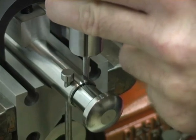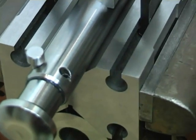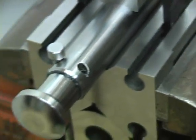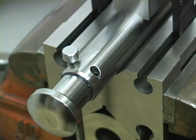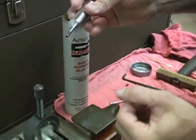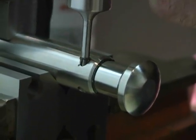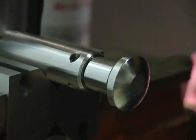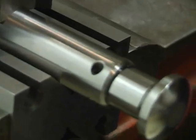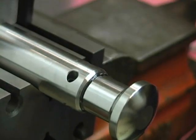You should recess the pin slightly below the edge of the hole. You don't want the pin sticking out at all, and if you drive it too far it will stick out the bottom. Then install the pin on the opposite side — a little grease again will help hold the pin on the driver. Use a slight angle to get it started, then drive the pin through. You want it just a little bit below the edge; if it's sticking up, just a few more taps to get it down underneath the top.